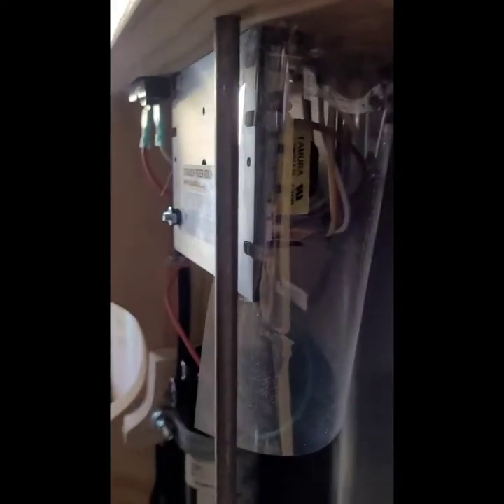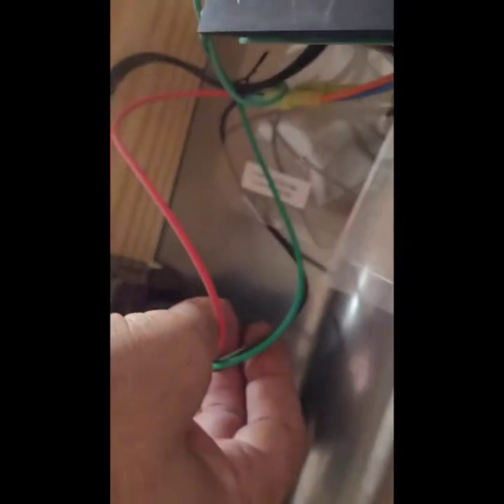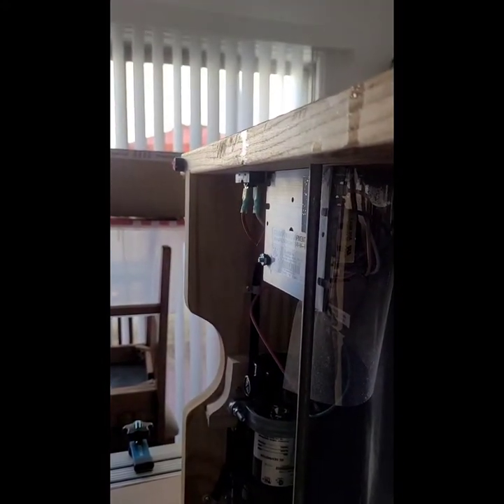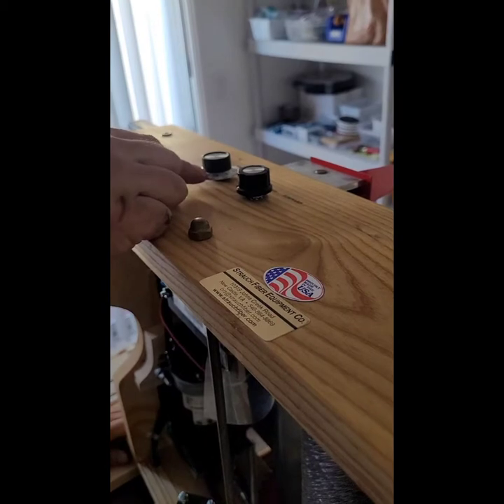Any of these wires in this housing - if something happens and the motor's no longer working - to replace the motor and the wires, they're going to send it to you with all the wires, right? The wires will be coming out of it. The wire will be out of it and you're going to cut and trim everything to match. So you just keep your previous one and reconnect it to your switch, your rheostat, and your power - what the fuck is a rheostat? The speed controller - it's a rheostat. Calling it a speed controller is more clear. A rheostat is anything that regulates power - like a light switch has a rheostat on it to make it brighter or dimmer.